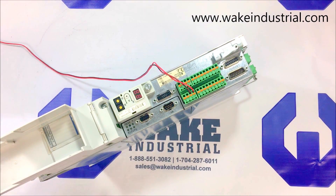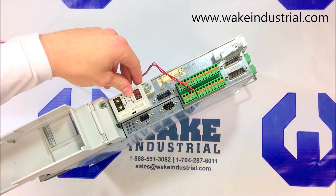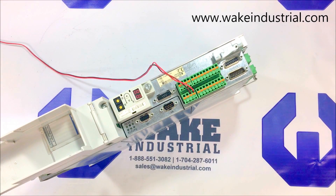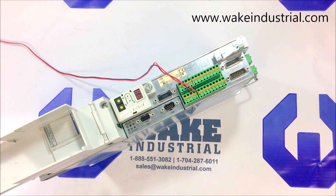For example, it can be an SMT for machine tools or it can be an FGP for general purpose automation. These drives can be powered on with 24VDC, turning on the internal bus amperage for the fan, the boards, and the option card components.